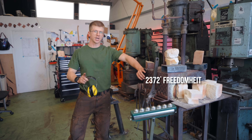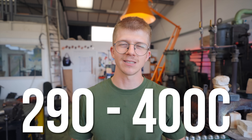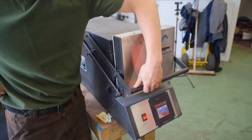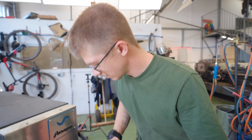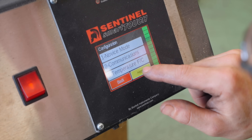It is now time to heat it up and forge it. This gas forge gets up to 1,300 degrees Celsius, which is about three times as much as is required to set magnesium on fire, so we don't want to do that. Google says 290 to 400 degrees Celsius is somewhere about the forging range of magnesium. Considering the risk of burning down this entire business park, it would be prudent to stick within that range. And look at this — alive from the dead, I have had this Paragon heat-treating oven sitting under the steel rack for four years, and finally got somebody in to fix it. Change of fuse — it was just a fuse. This beautiful beast of an oven is now ready to use.